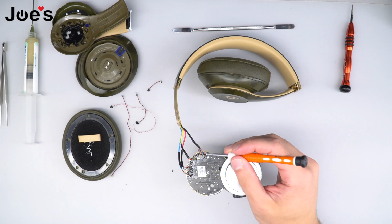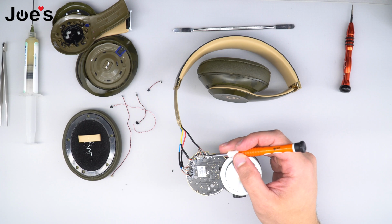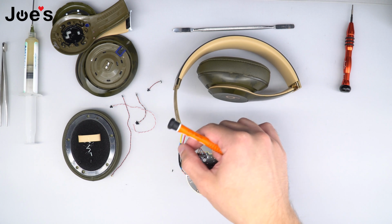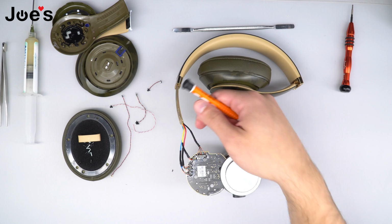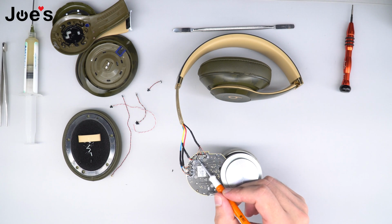So the first wire right here that we soldered, it's the black main wire, and on the first point it's red, copper. We got blue, we got green, we got red, we got green, copper, and then copper. And right here we got the yellow wire. Make sure that you do not intertwine it with the red. We're going to solder the yellow wire onto here, and we're going to do green on the first point.